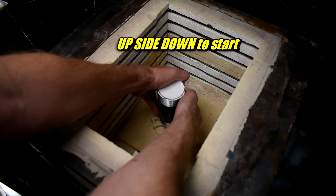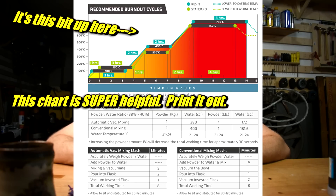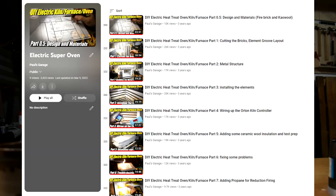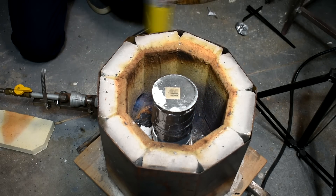On to the burnout process. You've got to take this, let it sit for hours, and burn it out - putting it through a burnout schedule according to the manufacturer, which they have published on their website. I used my electric heat treat oven that I built years ago. You can't use a kitchen oven - it just doesn't get hot enough. You might be able to use a propane foundry furnace, but you don't have a lot of temperature control there. You put all this work in, you kind of want to do it right. Don't screw it up because you used the wrong burnout process.